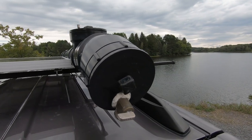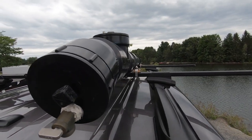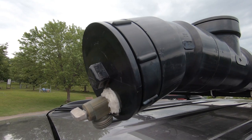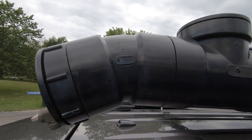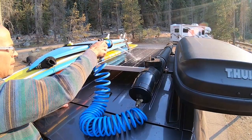For the back end of the tube, I did the same by putting a removable cap. Also, at that extremity, I used an angle fitting to create a low bottom point to fix the faucet. Effectively, to use all the water in the tube, the faucet must be lower than the bottom of the cylinder. That way, you can use all the water capacity of the tube.